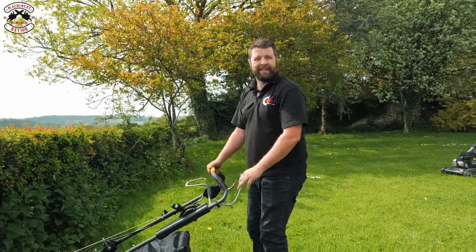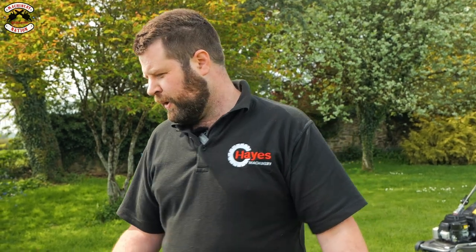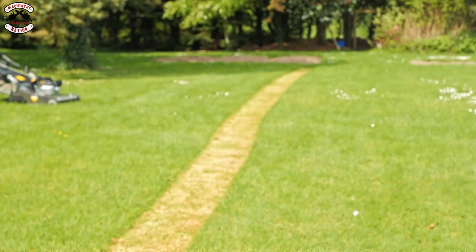I think I've filled the bag — it's properly crammed that grass box full of grass. Now, 25 millimetres might be a bit short for this garden — I've sculpted the lawn so the boss man's not going to be too happy. We're going to move it up to 42 millimetres to get some nice pattern on the lawn. And you can see with the standard blade on this machine what it's cut and bagged — pretty impressive.